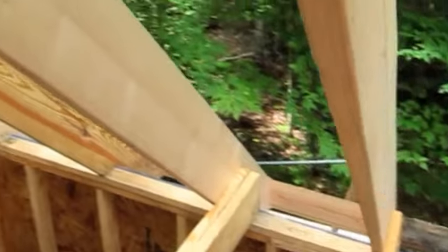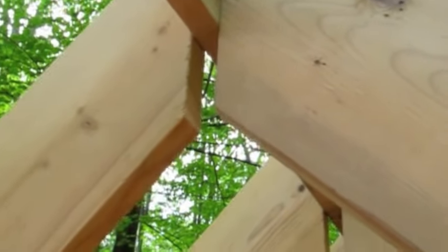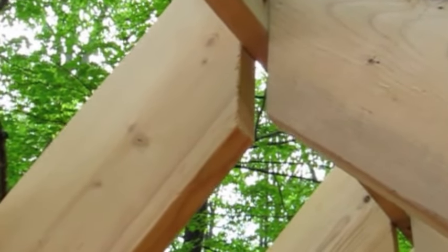There are other ways to make roof rafters stable. You could put the collar tie up a little higher, you could put it up here. You can put gusset plates up here. The ridge beam itself can be supported and take a lot of the weight. There are all different ways to skin the cat.